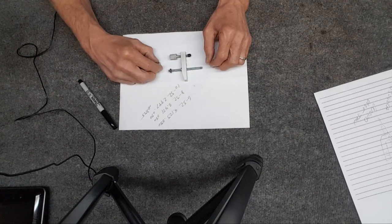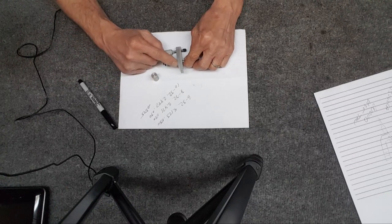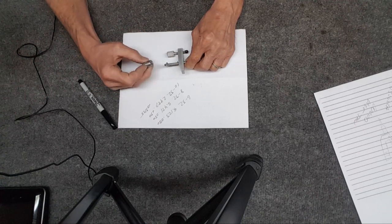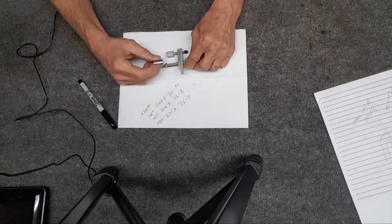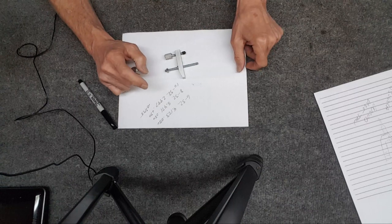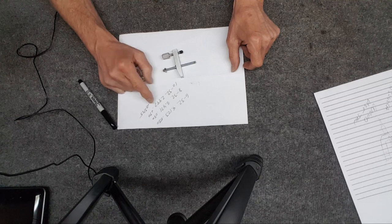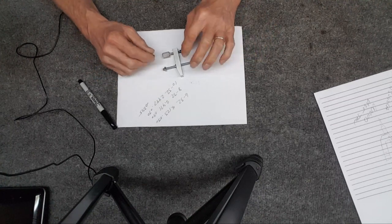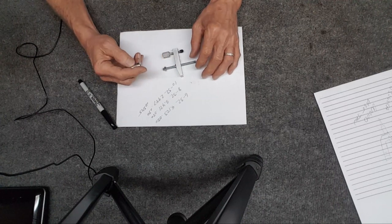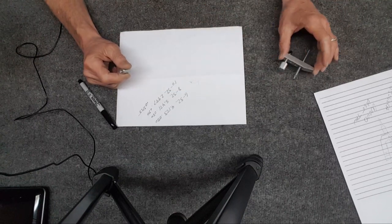And I believe I had that. I had a rethreading die that I had threaded what was going to be a screw, and a nut went on it just fine all the way. But when I tried the thread protector, it only went on so far and jammed. So be aware, if you're turning a screw or something on the lathe, it's not accounting for the helix angle, and you could wind up in a problem if you're making a screw that's going to go into a deep threaded hole.